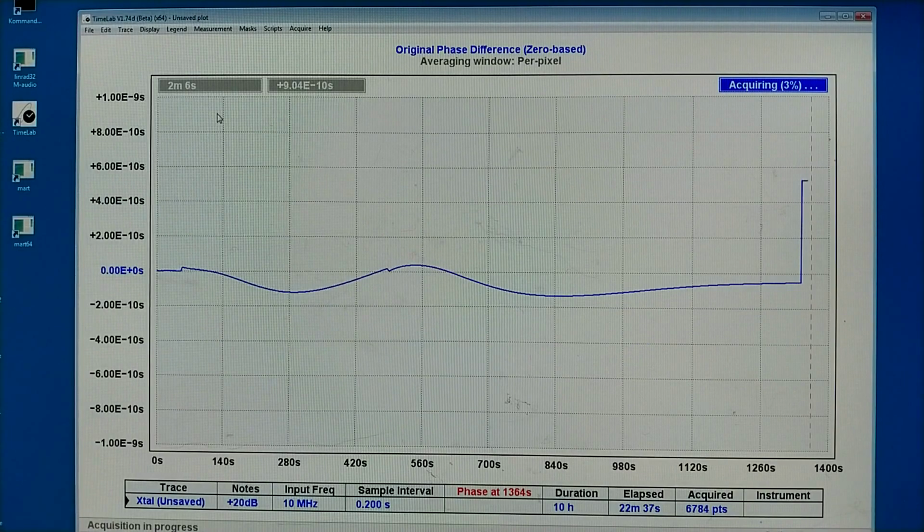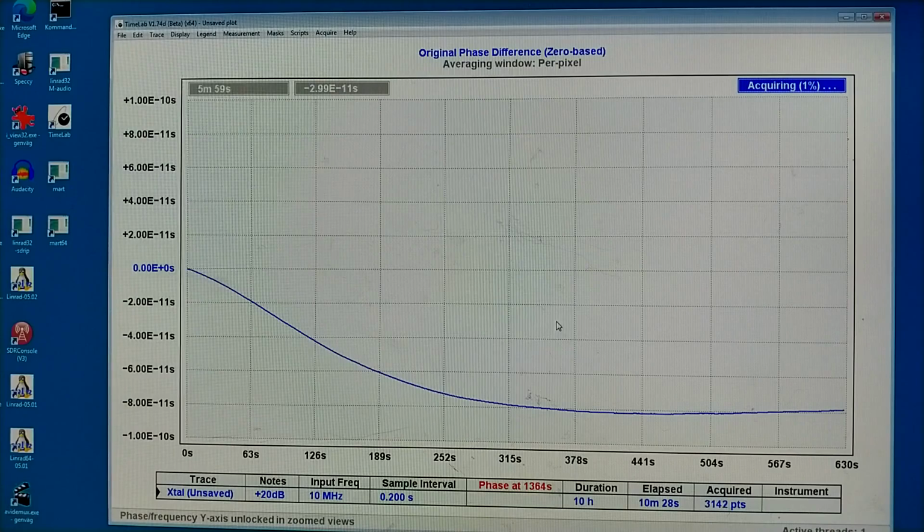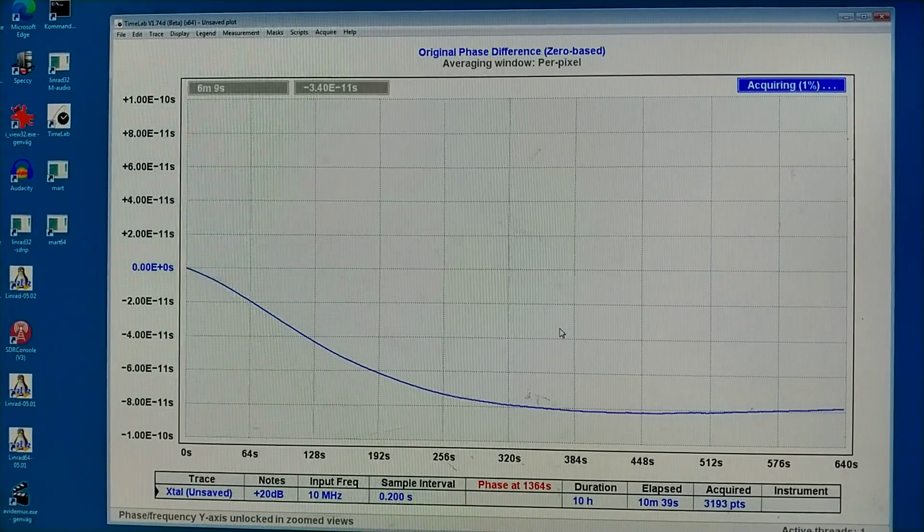And then I check again by setting the temperature a little bit too high and wait for where the new optimum phase comes. Now this is pretty close. There is a minimum here, and the temperature is going past it, but not very far. So I will look if there has been a difference on the Allan deviation because of this. I mean, is there a thermal noise due to a bad thermostat, perhaps?